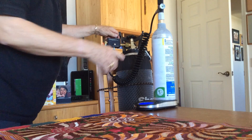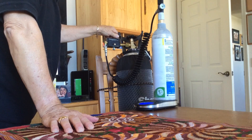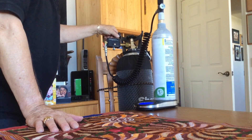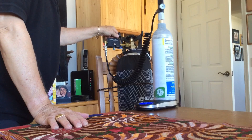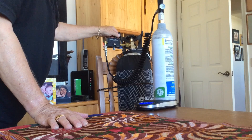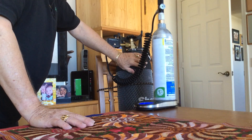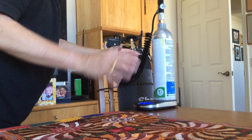This is open and now I'm going to open this up and fill it to 33 ounces. You can hear the bottle shaking a little bit because liquid CO2 is going in there and splashing — 7 ounces, 9 ounces, 10 ounces, 12 ounces. It should get to about 25 ounces and stabilize in pressure. There's no pump — it's just 800 pounds of pressure pushing it, and this started at zero. When this gets to 800 psi it's going to stabilize and stop.